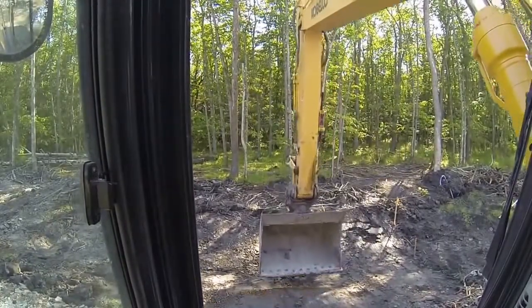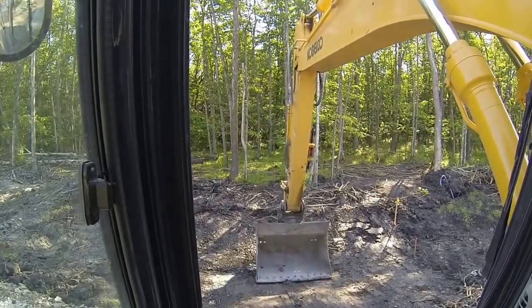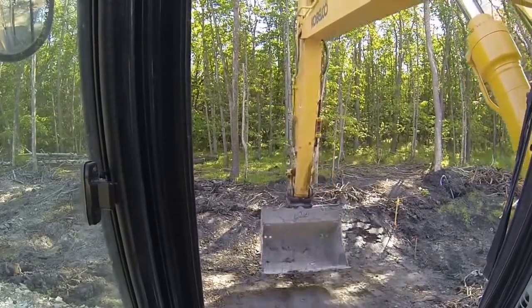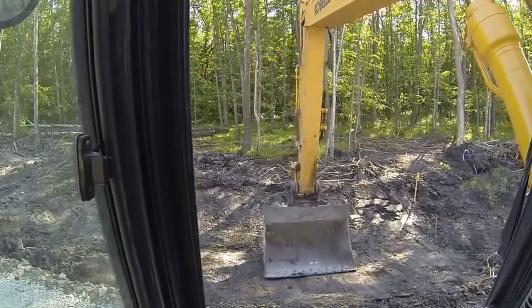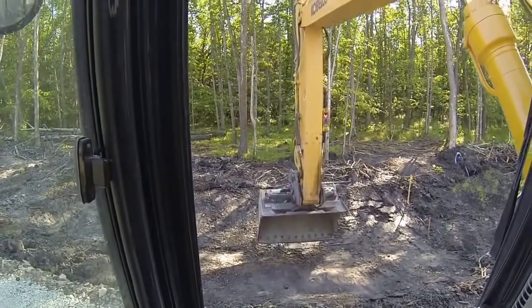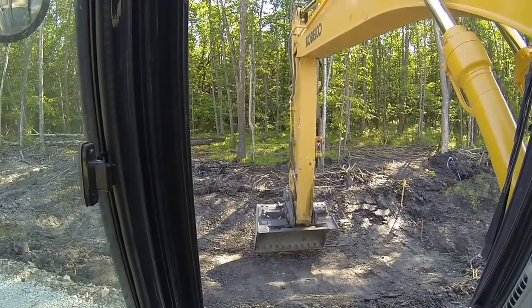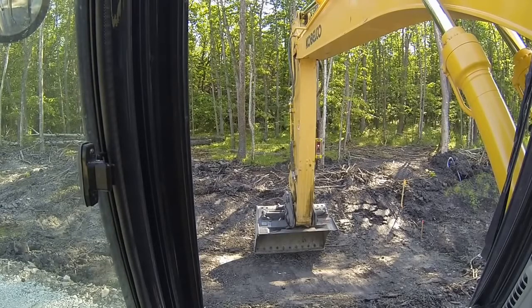I have to admit, some of this is a little bit new to me. I've used lasers for digging before, but mostly for digging flat grades, such as house basements. And those lasers, I think there was only one I used that had this capability, but I always had it zeroed, so it would do a flat grade. Whereas this one's at 0.271, so you have to have the laser facing the right way, because one way is going uphill and the other way is going downhill. And right now I'm working from right to left here, and going left there is going uphill.